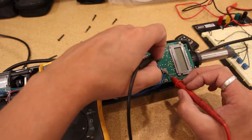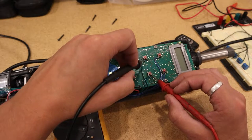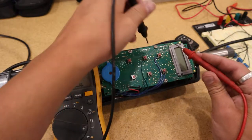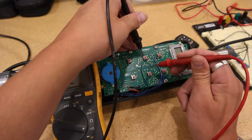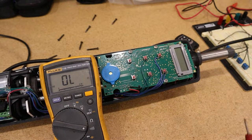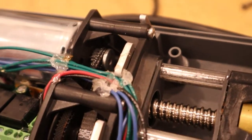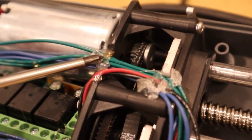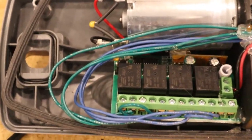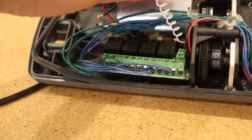In this clip I'm showing that each pair of left/right buttons only requires three wires back to the controller rather than four, because they share a common pin. That really matters because by the time you run all the wires from the buttons all the way back to the control unit, it's quite a lot. I wound up with eight wires total to run back. The biggest challenge was getting them past the motor section — I used a die grinder to notch out the plastic, then hot-glued it in place.